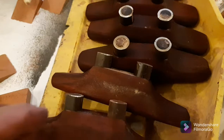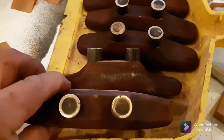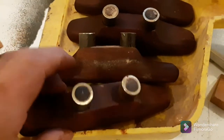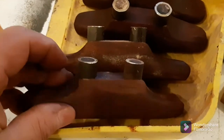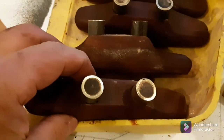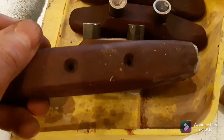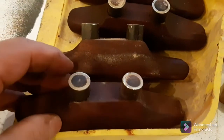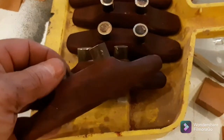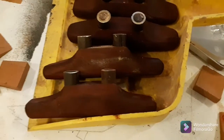All the cleats now have their bronze rings attached. They seat into the holes I drilled, and I've plugged them with some doweling I had. I left the burnt bottom after sanding them flush, and now I'll drill all the way through down the center with the same jig as before. Then they'll be urethaned and ready to use.